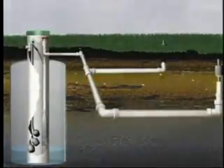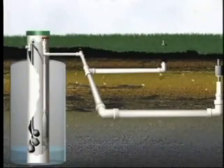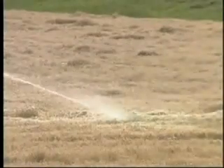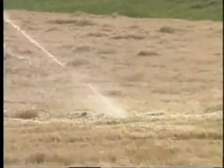The tubing can be placed within the existing landscape. The dispersal system utilizes a pump tank, pump, and spray heads to distribute wastewater on the surface of the ground. The pump tank stores the water until it is time to dose the water to the spray area. The system can either be an on-demand system which sprays the water whenever the tank is full, or a night dosing system which holds the water until night and then disperses it. Most residents prefer a night dosing system when the effluent will be sprayed in the landscape.